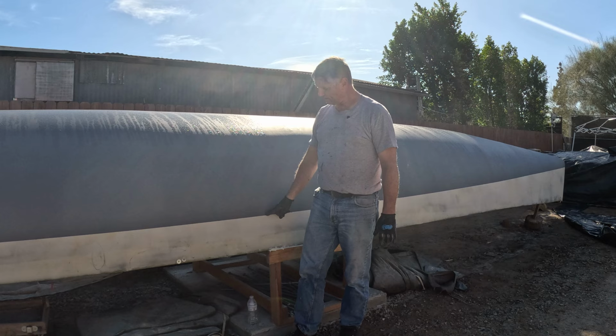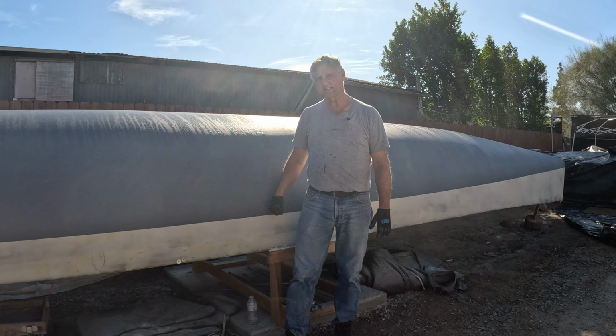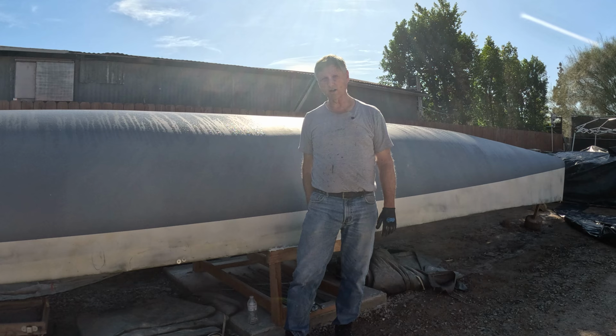we want this barrier coat, which is an epoxy, to have more time to set up even harder, because epoxy will seem to get hard right away within 8 hours. But it really takes longer than that, several days before it becomes to full hardness. And we don't wanna scratch this and such messing around with these things. So we want to make sure that this epoxy is real hard. So we'll give it till tomorrow as well, and that'll give it 5 days since we put this on.